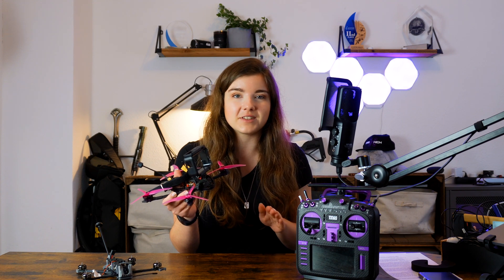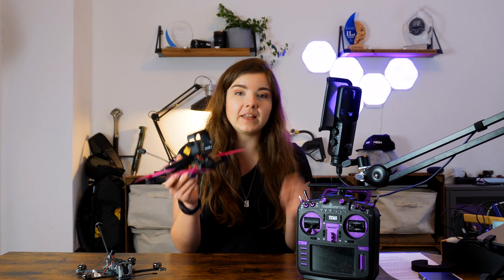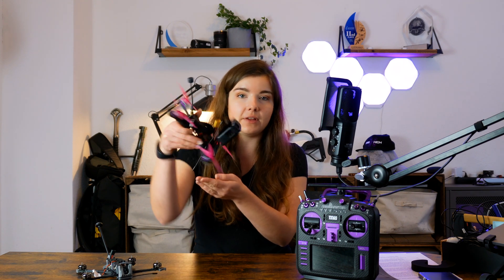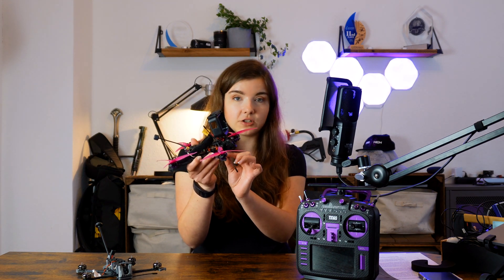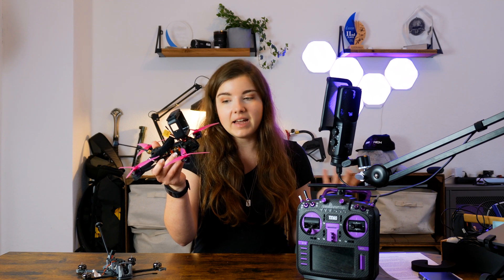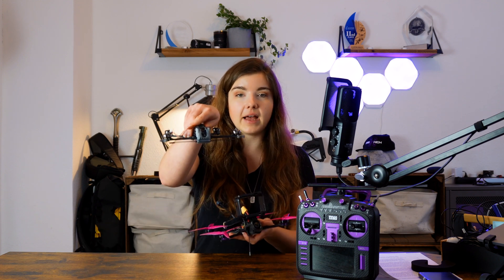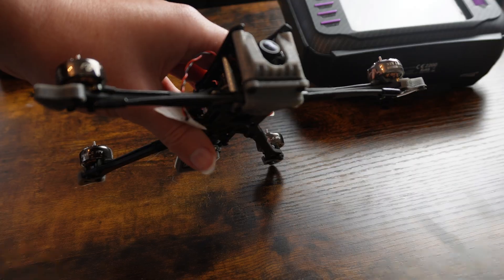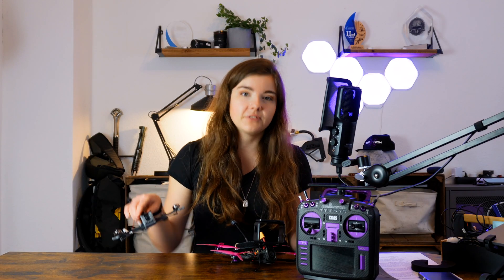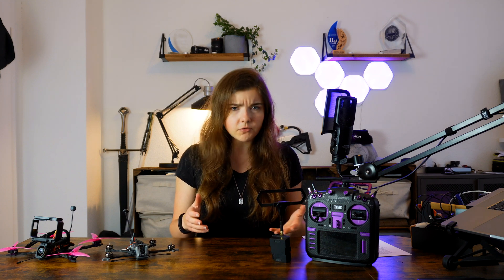Mine is on a little mount so it's kind of further away, but it's absolutely not perfect — it's still too close to the FC and ESC. It has to be clear from anything and safe from your turns, so whichever direction I go, the antenna pole will always be within range of my radio. The antenna shouldn't lie flat because when you turn it's really unfortunate — it has to stand upright, though you can destroy it during landing. If you have two antennas, having one on the front and one on the back is absolutely okay, and having them further away from carbon is the goal.